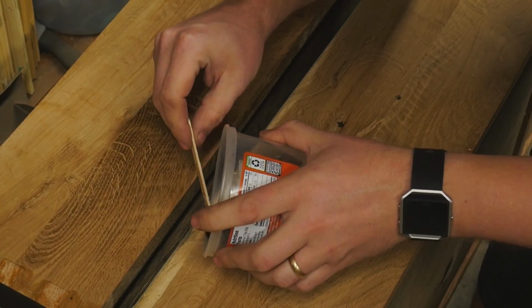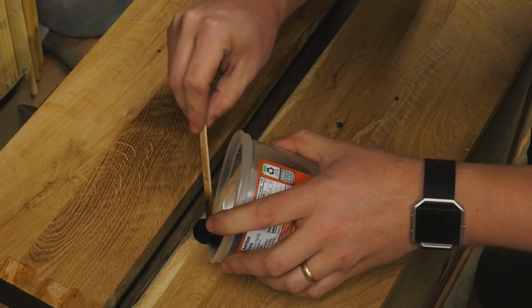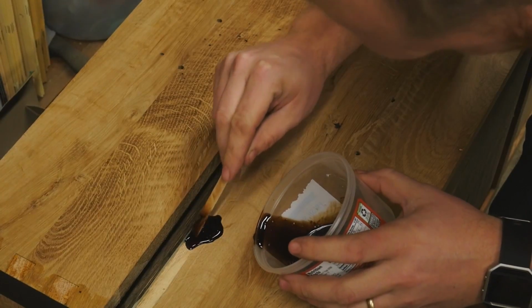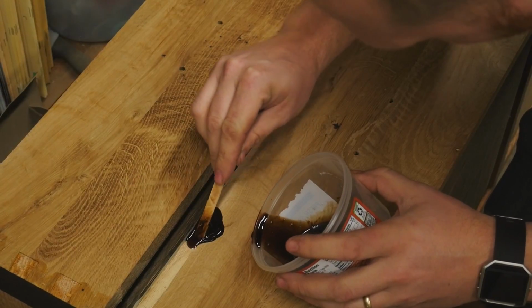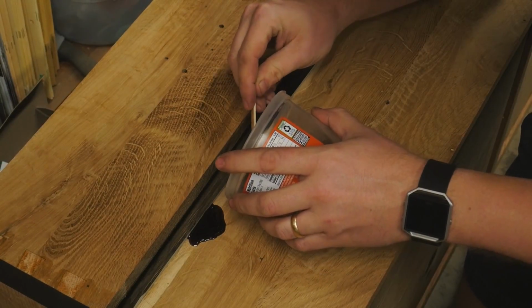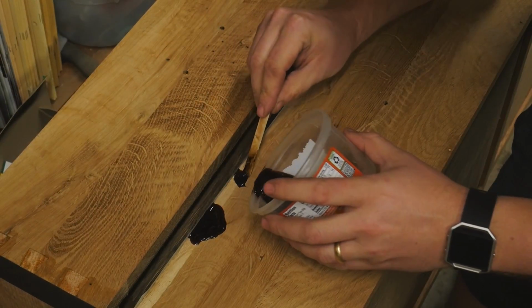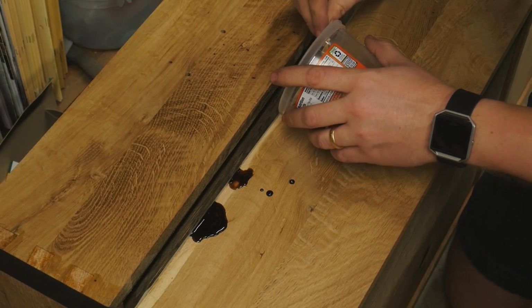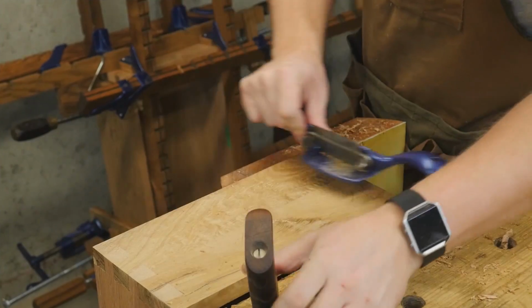And then I can put it into the voids, cracks, and holes on the dresser front. This is a very, very figured wood, and with that you're usually going to have a few voids that need to be addressed. But with a little bit of work I can put it in here. I'm using gaff tape as opposed to masking tape. I much prefer that for masking off epoxy. It works so much better. It adheres well and secures it.